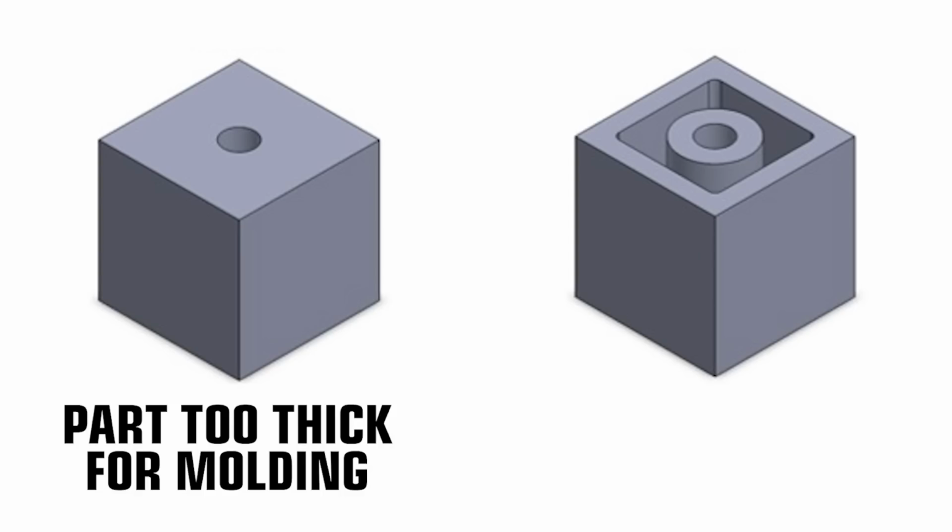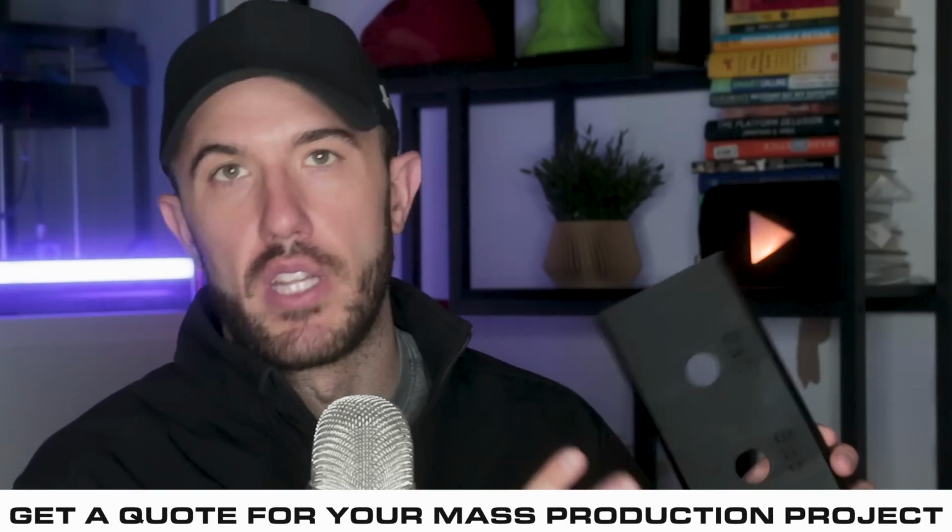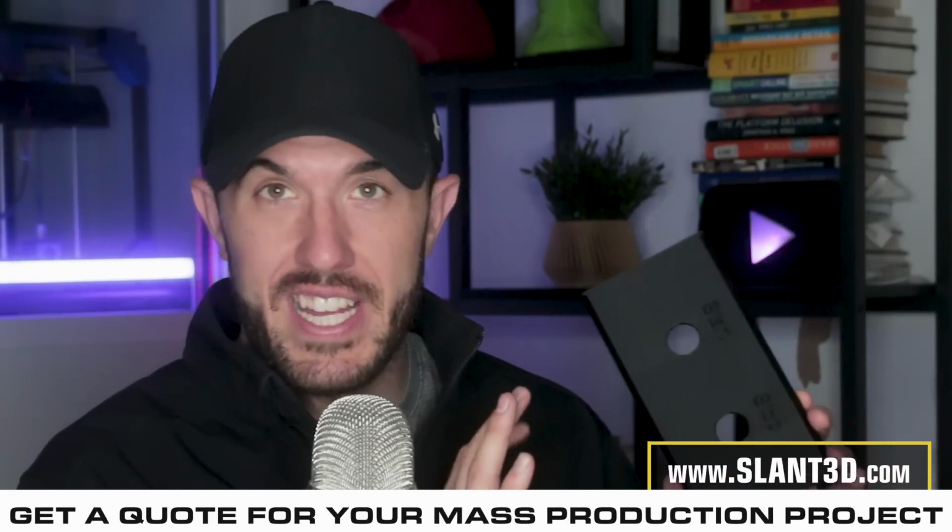When designing a panel cover like this, number one, you really want to lean into the fact that you are not restricted to a particular thickness of material. You can make it as fat and chunky as you want because you can have all of that rigidity and we will fill it in with infill. But in this case, we made a panel cover that was 2 to 3 millimeters thick throughout, just because that's very often what comes back towards us from existing designs. So we're going to try to pull from that.